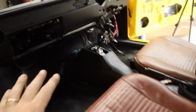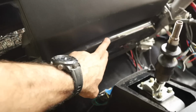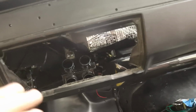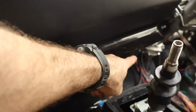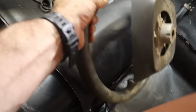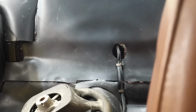All right, we have the seats in, we have the heater unit, as you can see in the back there. This panel under here, that's actually the ducting for the air conditioning. So the basic setup is in there. It is very, very tight. And because I haven't actually fitted everything in yet, I'm just looking at it and realizing that this air conditioning unit has got 2 air conditioning lines that need to run down along the tunnel somewhere and through into the little bulkhead I've made here, along over where the back seat was, and then up into the air conditioning compressor in the back.